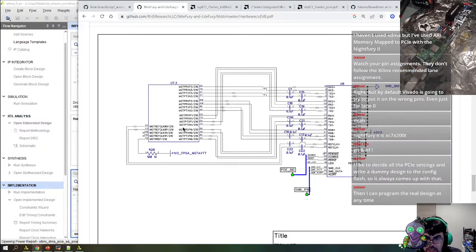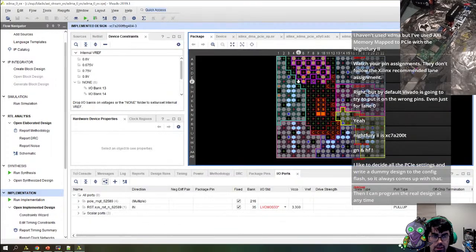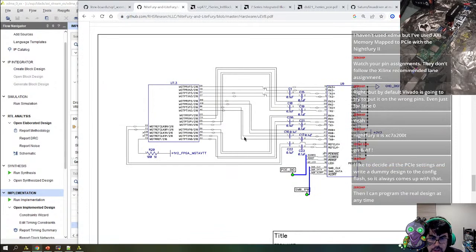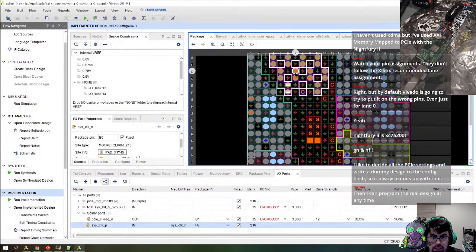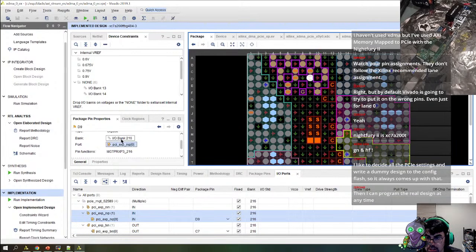So what we want here is we want to do lane 2, the MGTP lane 2, our B810A6, which should be what I wanted. Is that not working out? Okay, let's investigate. Okay, so this is MGT clock 0216. That looks correct. And then we want these. I guess we could look at the, I don't have the compute blade schematic. So we want 2. Is that what this is? It's 3. Why is it 3? Okay, this is on the wrong one. Yes, it's on the wrong one.